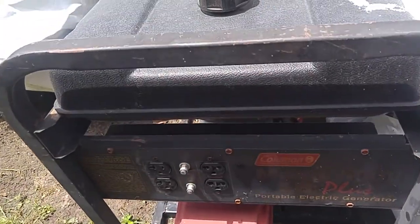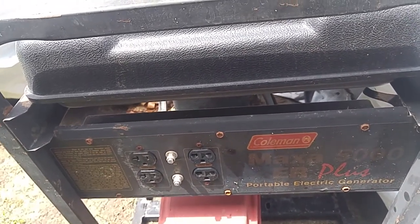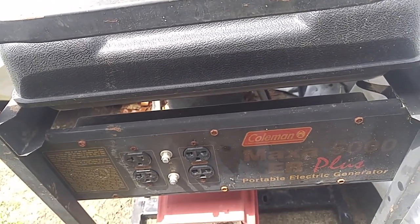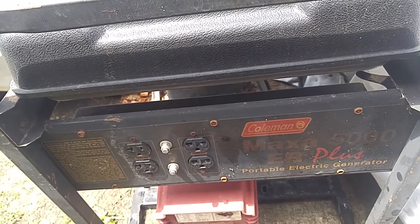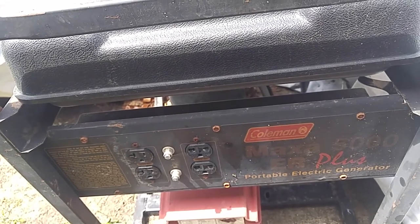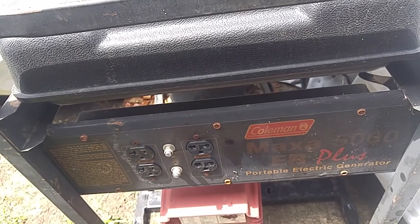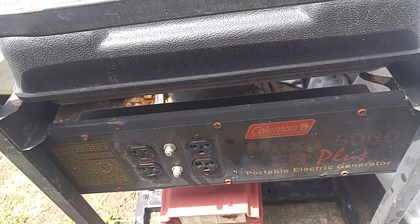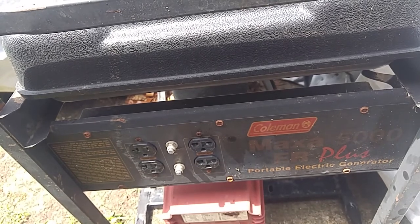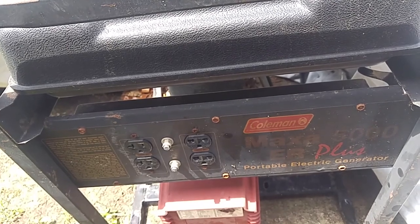If this isn't overexposed, for today I have to determine the wiring. So I almost can make a combo where I use, well, I guess first off I could just use that panel. So I could use the donor machine's panel, swap that in, but then I won't have the lock style plug. And I just checked my arc welder, at least the IGBT solid state welder is the 3 plug, is it L630 NEMA? I forget exactly, but it's the 3 prong style lock.